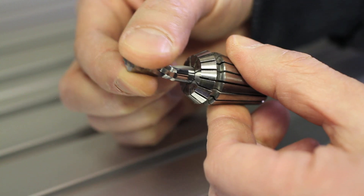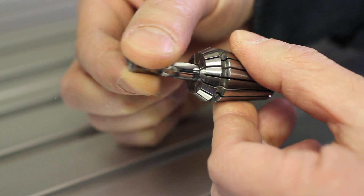The bit is held in place by friction. As you tighten the collet nut, the collet itself tightens around the shaft of the bit. In order for this to work, the contact between these parts has to be smooth and uninterrupted, meaning any little tiny piece of debris or sawdust that's in there is going to mess with that contact.